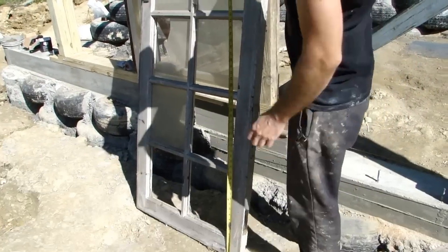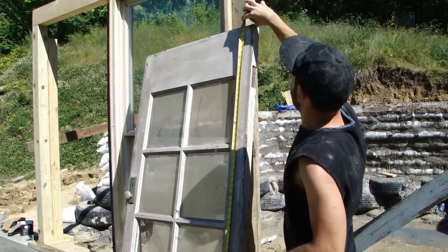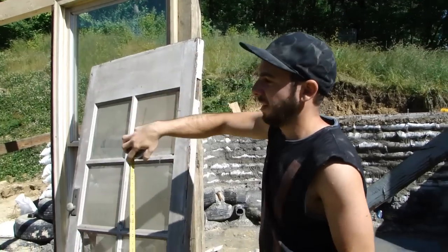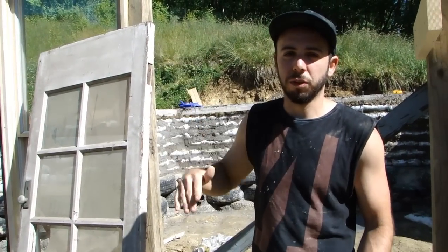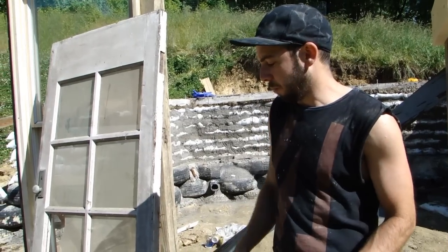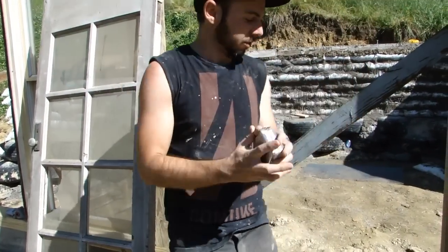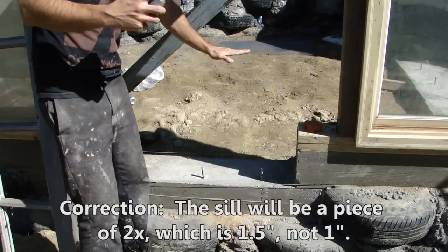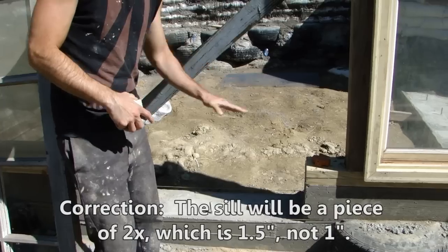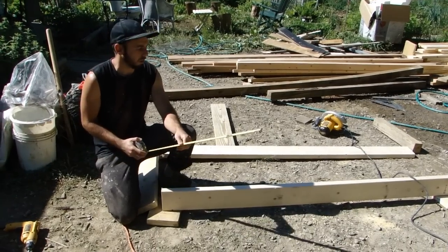For height, it's six foot six and three-eighths, so we have an inch and five-eighths of space gap height-wise between the door and the jamb. That's because we're going to be putting a sill down on the bottom. We'll make our jamb, set it in here, and put a nice seal on top that you'll actually walk on — that's going to take up about another inch.